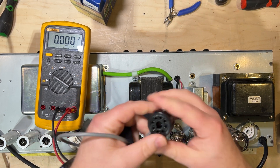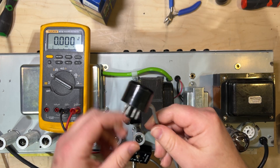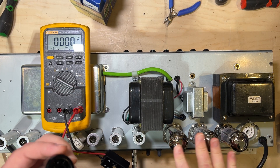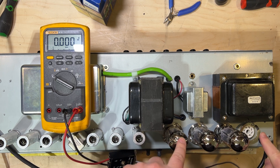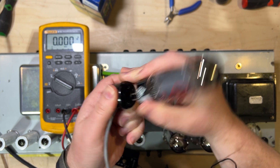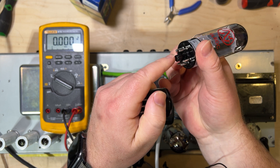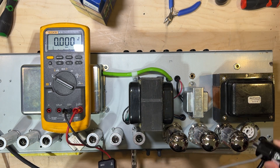This probe goes in between the tube socket on the amp and the actual tube under test. They make these with two or four probes so you can test multiple tubes, and they also make versions with their own built-in display. On an amp like this with four tubes, using the single-probe style you'd have to test one set of two tubes and then the other. We already got everything biased up with the ComputBias, so we're just going to do one set. Be careful that the keyway matches — there's a little line on the plastic of the base that lines up with a hole on the socket side. Do that for both the tube socket and the tube.